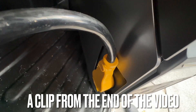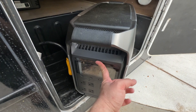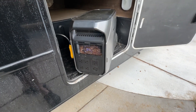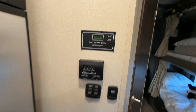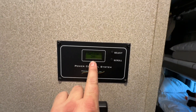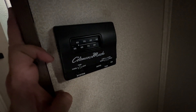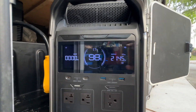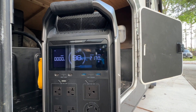Plugged into the EcoFlow Delta Pro 3. Here's the EcoFlow Delta Pro — let's turn this thing on and see if it runs the air conditioners. Lights on, cool. It thinks we have 30-amp service. Air conditioner one is running, air conditioner two is on cold. Output: 2145 watts, telling me we've got about 1.7 hours left if these were running full throttle.